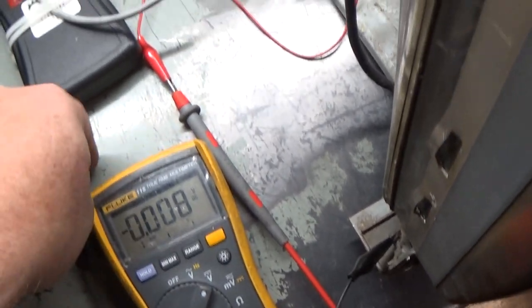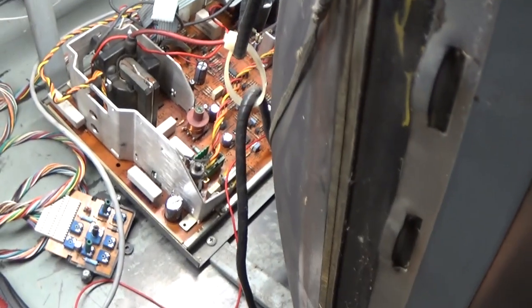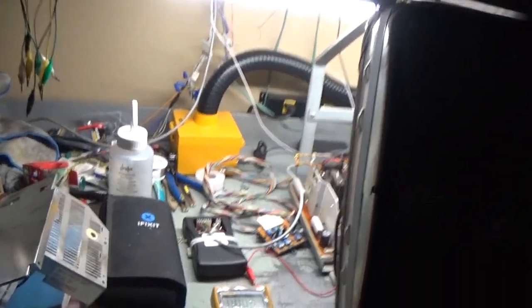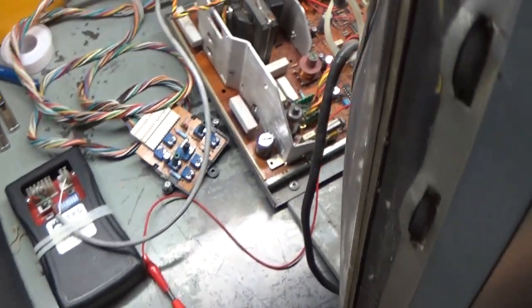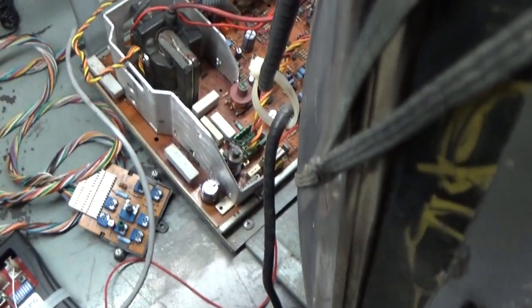Yeah, we're set up on our test point 6 right there. And we want to make sure we're at 138, and I got the driver ready to adjust the pot. So let's see if we have success here. I need to shut my light off so we can see the tube. We're looking to make sure that our cap doesn't explode and we don't have collapse, and we have 138.